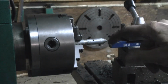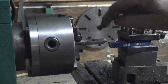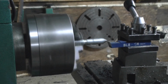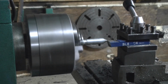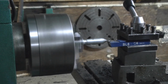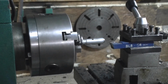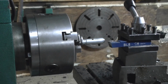Alright, I have a little carbide cutter here. I'm going to shorten the end of this base because the hole here that I want to use to pin this rubber on there with is quite a ways from the end. So we're going to shorten it up a little bit. Okay, I adjusted it where I could cut a little better. I was running out of cross feed here.